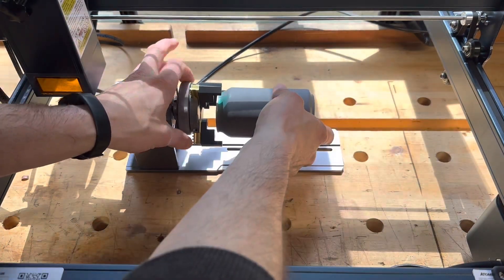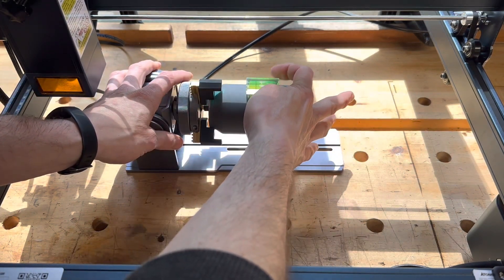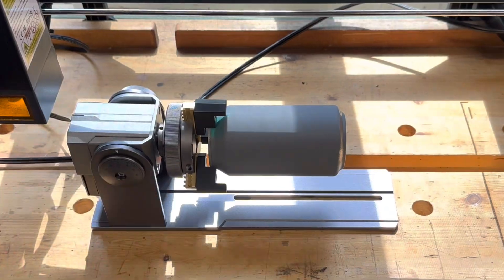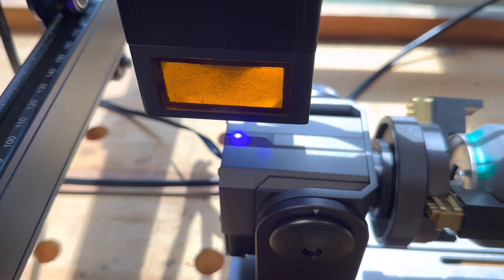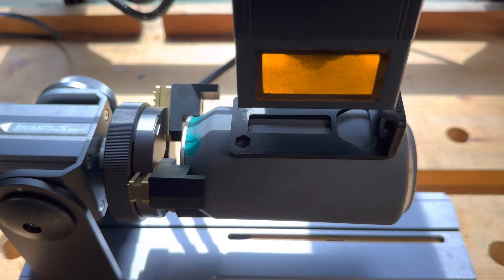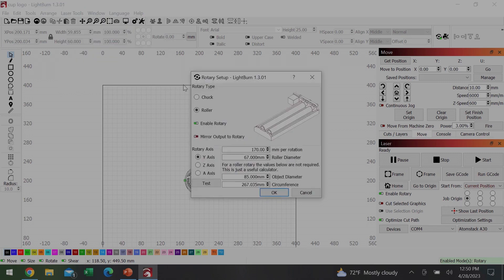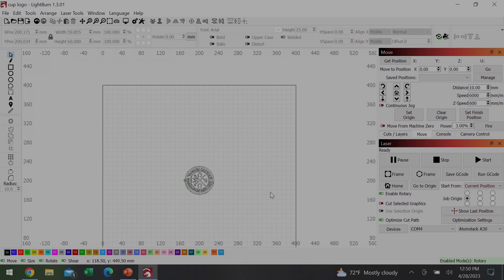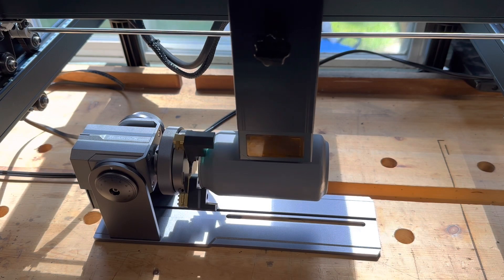When you turn the laser on and it does the auto home, you'll want to make sure the laser is high enough that it doesn't hit the chuck. It's important to make sure whatever you're engraving is as level as possible — for curved surfaces, you'd want the center of your engraving to be where the level is. Getting the Y axis aligned on the rotary chuck is really easy: after firing the laser, you just move it to line up with the little notch which is dead center on the rotary axis. Then set your laser height, being careful not to bump the angle of your chuck. In Lightburn, go back to rotary setup and change it to the chuck type, and set the object diameter based on whatever the fattest part of your engraving area is.